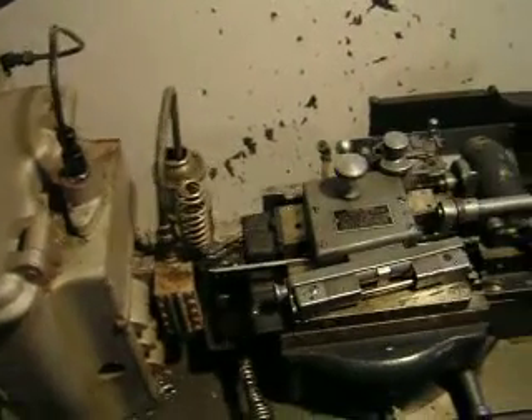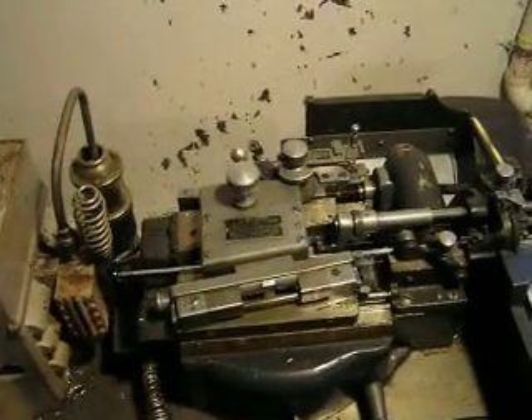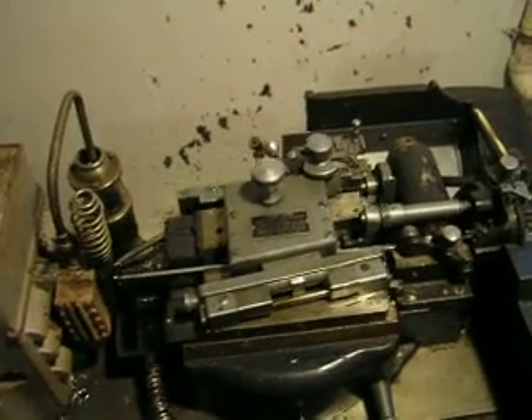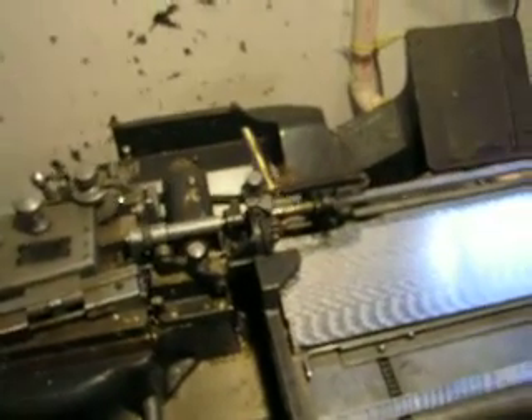Even so, you can hear the loud thumping. That's because it takes a lot of force to pull that metal out of the mold. This is the puller that's doing the pulling. It's adjustable from basically no pull at all until about six picas. Right now it's pulling about three and a half picas.